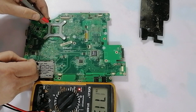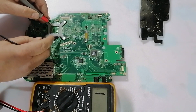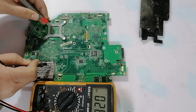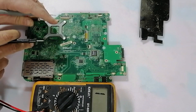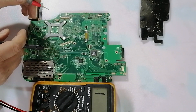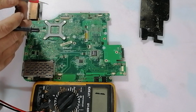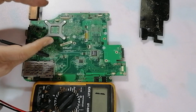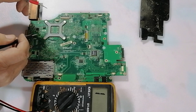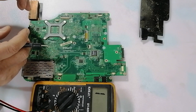This is not short — as you see, between the ground, this is not short: 26 ohm. Why? Because the processor contains billions of transistors connected to each other in parallel, so it will read a low resistance.